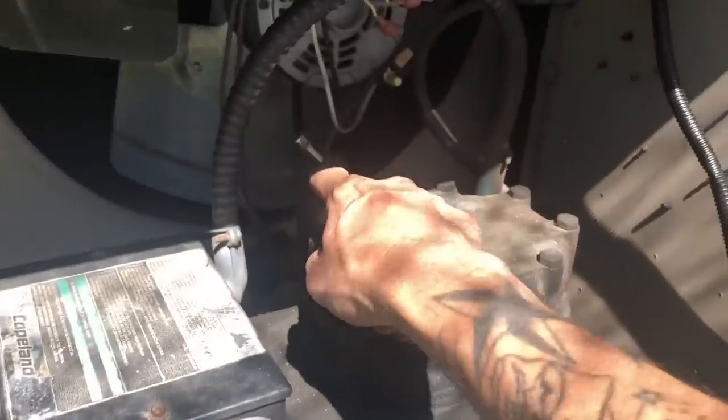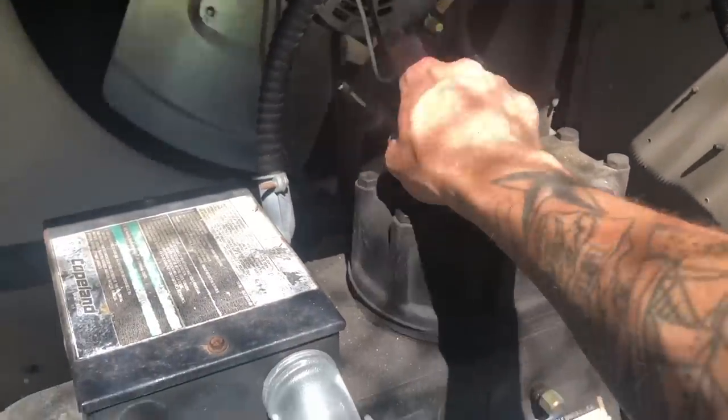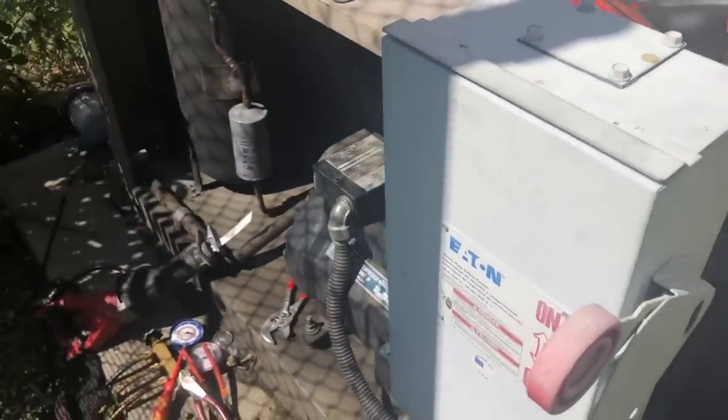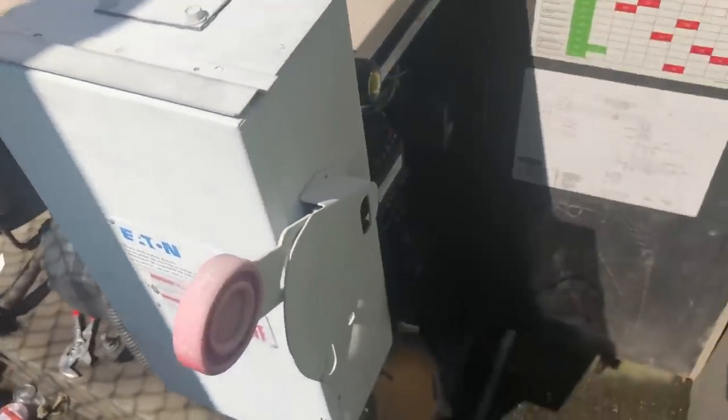After this I'm going to secure everything up. I already vacuumed out the compressor and opened up my lines. Always remember — especially this discharge valve — that's got to be open, suction lines open. I'm just going to secure this and neaten up the wires in here, then we'll be ready to go. In a couple minutes she'll fire up when she starts calling again. Then open up our receiver tank, let the gas get through the system again.